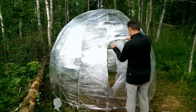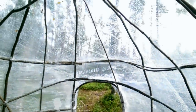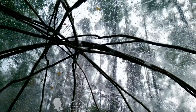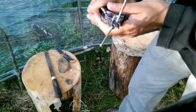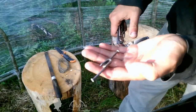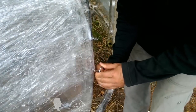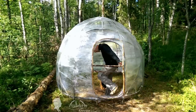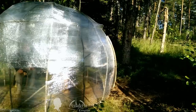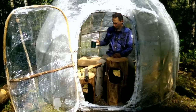When I was cutting out the opening for the door, the rain got heavier and I hid from it inside. I noticed that even without the door, the rain wouldn't get inside much. Now I need to install the hinged door and the dome will be complete. I made simple door hinges from two nails and a piece of steel wire. I bent the nails into hinges and secured them to the door with wire, then bent a piece of thick wire into two screw eye hooks and secured them to the door frame. The door is so light you can make hinges even from a tin can. Lastly, I wrapped the door in stretch film and installed it. Note: the tension of the plastic wrap changed the door's curvature, so there is a small gap between the door and its frame. I fixed the gap later by adding a longer spreader to the door.